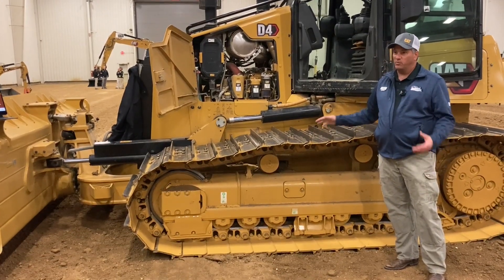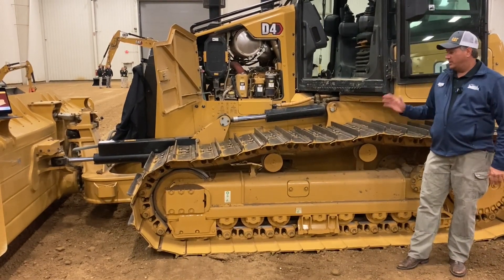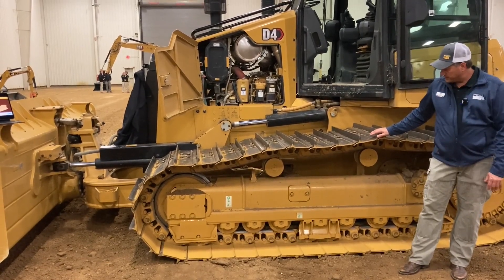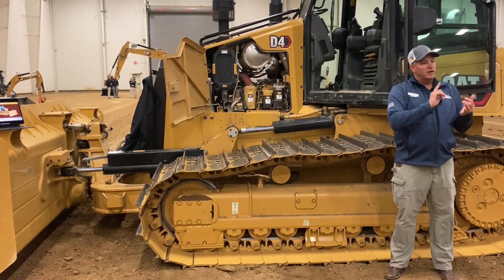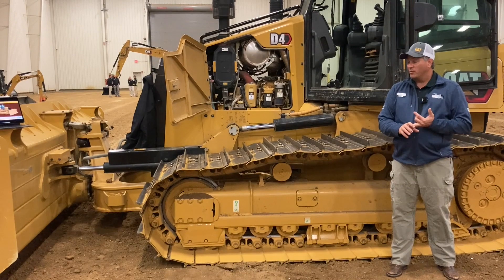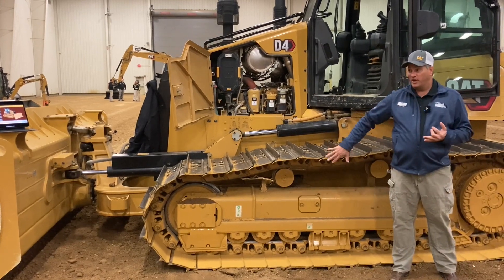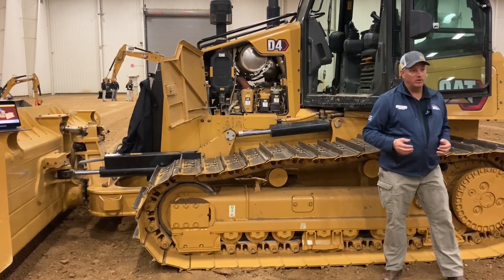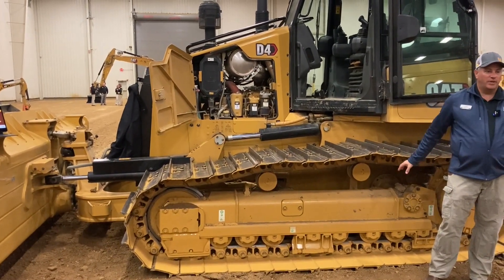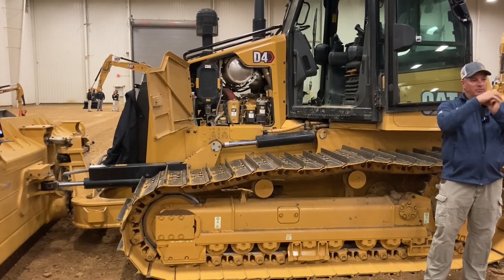This keeps that joint together and keeps the oil inside so it can lubricate, improving the durability of that track system for longer hours. It's still a serviceable track — if a customer wanted to push those pins and bushings out, flip them, and put them back, they could. We still made it serviceable even though you typically don't see that on this size of tractor. The other undercarriage option is what we used to call System One, now rebranded as Cat Abrasion — our rotating bushing track that reduces that contact point between the bushing and the sprocket.